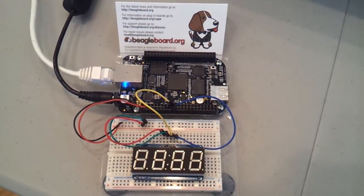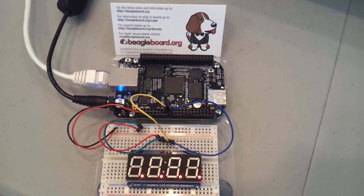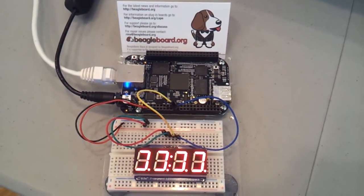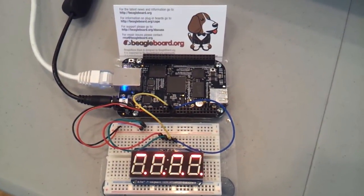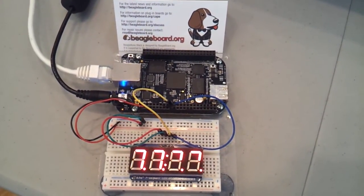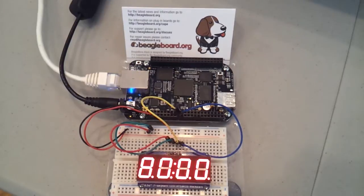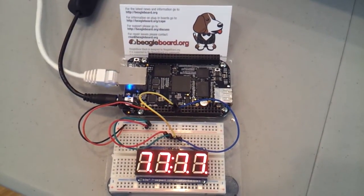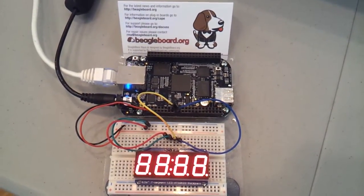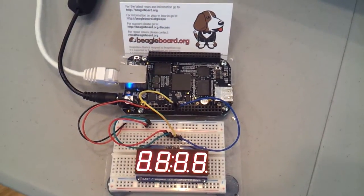On their learning system, I went through the steps to install their Python library, and it works very similar to the Raspberry Pi's RPI.GPIO library. It turns out that the code example for the RPI.GPIO Python library for Raspberry Pi also works with the Adafruit BBIO Python library on the BeagleBone Black. Here is the example program from the Adafruit Raspberry Pi library running on the BeagleBone Black.